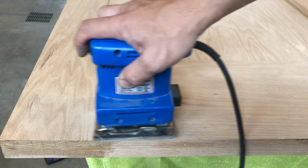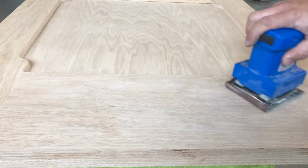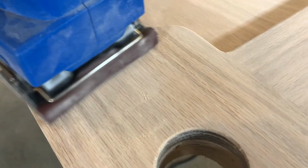The entire door is sanded with 120 grit sandpaper to ensure a smooth, uniform surface to absorb color stain properly. Surprisingly, the Harbor Freight orbital sander turned out to be a good purchase decision. All the sand belt scratches should be sanded off, or else they will show when stain is applied. Old and clogged sandpaper on the orbital sander will leave unwanted marks as well.